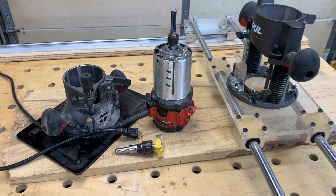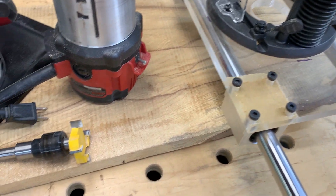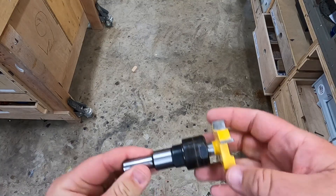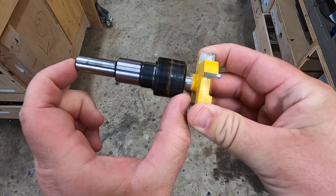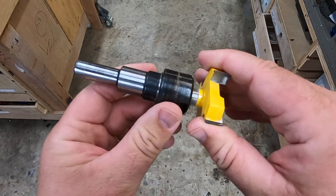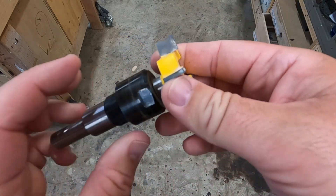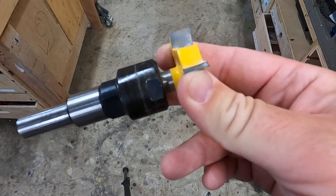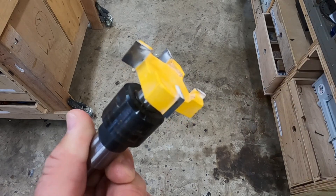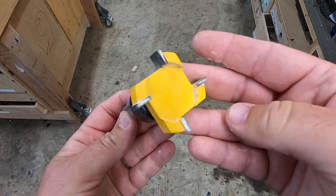I've permanently mounted my plunge base here, and my fixed base is permanently mounted to my router plate — I just switch back and forth. The next thing you need is a router collet extension. They're not expensive at all, but you need it because with the plunge and the way this raises up off your workbench, you're going to need that extension. As far as your cutting bit, this is a two-inch cheap bit — about $20. I bought these when doing reclaimed lumber with lots of nails I couldn't remove, so I could throw them away when destroyed rather than ruining $50-$60 bits. With clean lumber, a nicer bit will leave a nicer finish. Links to everything are in the description.